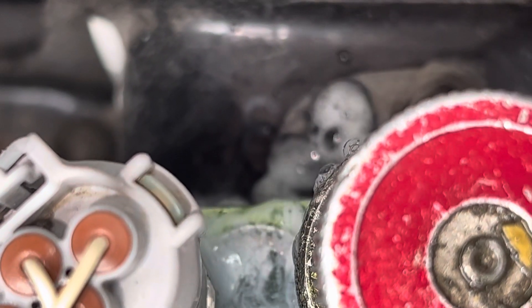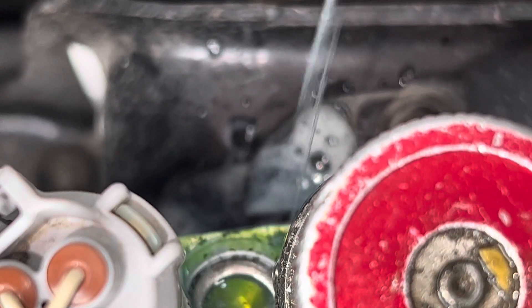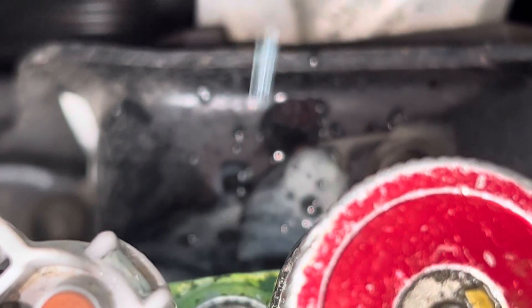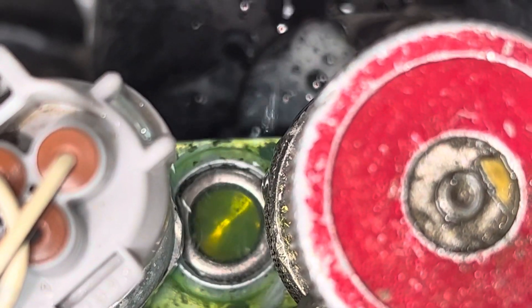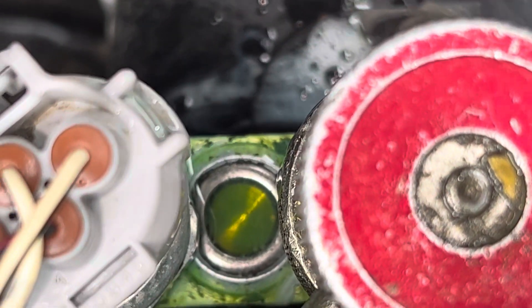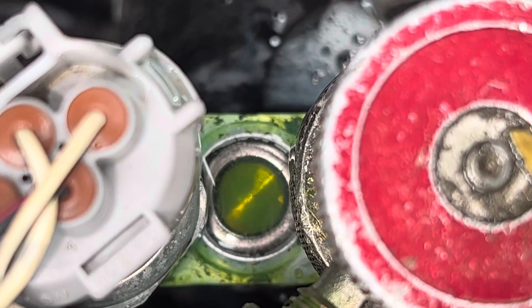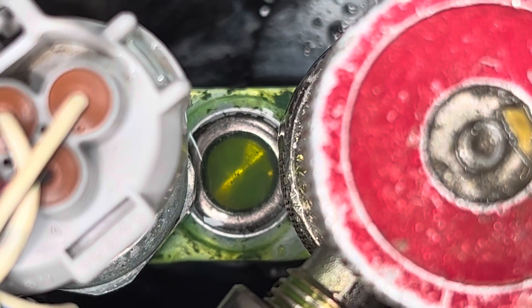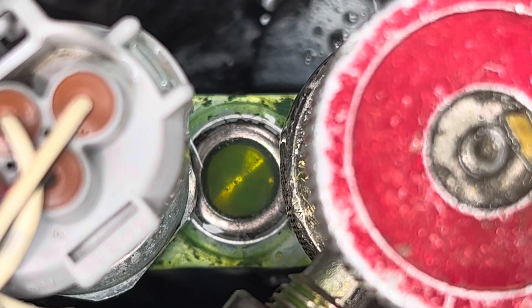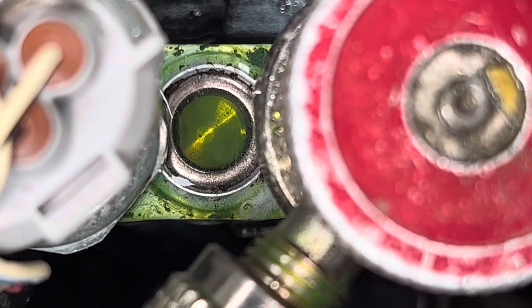This stuff is still on there, it's still thick. That was from inside my bottle because I had it sideways. Get it nice and clear. You can see how thick that stuff is — it's kind of a jelly product, really thick. What I'm trying to find is any little bubbles forming around that stainless steel washer that holds in the sight glass. It has a rubber O-ring in there, and I'm looking for bubbles to form somewhere when it gets hot enough.